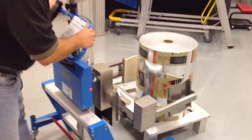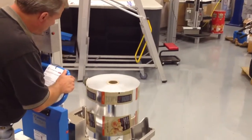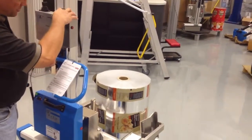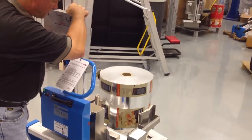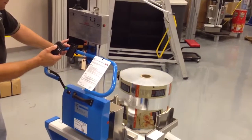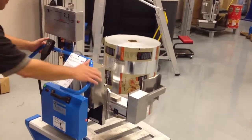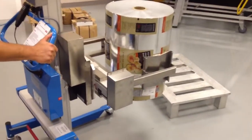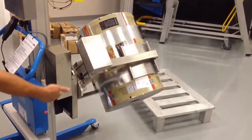You go in and align your left arm. We're going to center the roll up and press one button to close. We squeeze the roll and use the two-button remote to pick the roll up. We back the roll away from the pallet, then use the joystick to rotate right. We always want the fixed arm on the bottom.